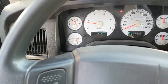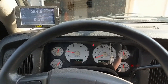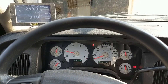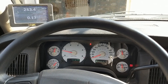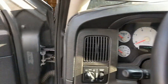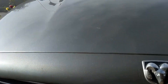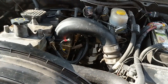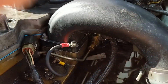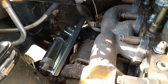No issues with the truck since I got it going again except for cold starts - I'm running a 12-valve tune so cold starts are a little difficult. One thing I noticed was that the gaskets for the intake air heater grid in the overhaul kit are not metallic, so none of the studs were actually making contact with the grid heater to give it a good ground. I ended up just making a ground wire for that, which hopefully will fix the problem.